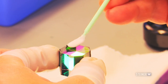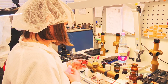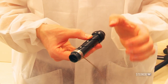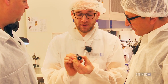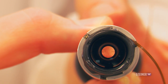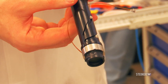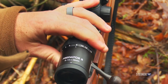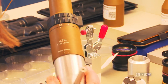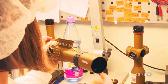When it comes to assembling the binoculars and riflescopes, every piece of optics must be put together by hand. Each product has many parts, some of which are extremely small. For the riflescopes, one core part is called an erector tube — Steiner makes all of their erector tubes in house. This part is responsible for several features including the reticle, which is the etched-in pattern of fine lines to help with aiming. The tube is also built with the ability to rotate so the image can be magnified. The erector tube is inserted into the housing of the scope and sealed, then each scope is tested by smashing it against a rubberized hard surface and checked for proper alignment and operation.